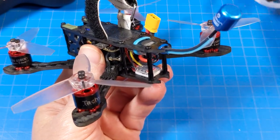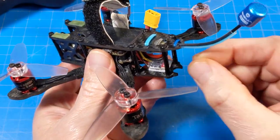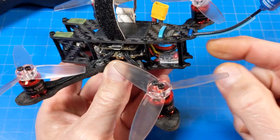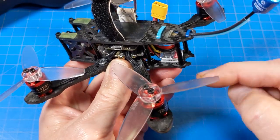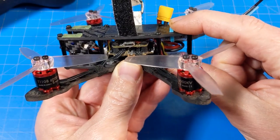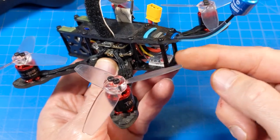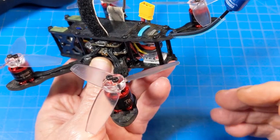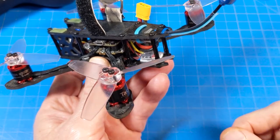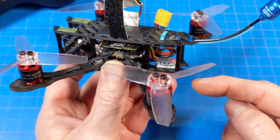I've got one of these installed right in here now. This is less than ideal and not quite what I described in the intro — it's not inside a whoop sandwich between boards. I wanted to put it in this build because it had an FrSky RXSR in it and I wanted to take that out, so this was a good opportunity. This isn't ideal for range — you're between two carbon fiber plates, the stack isn't very tall, and you've got some metal posts. For range, you'd want the larger receiver, especially if you want to go far out, and you'd want an antenna mounted proudly outside of your vehicle.